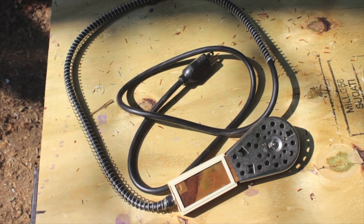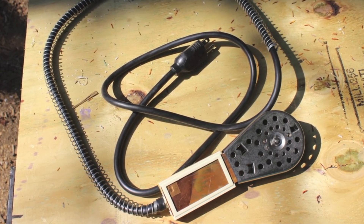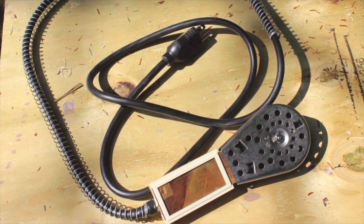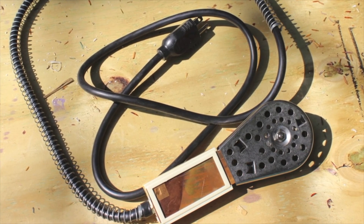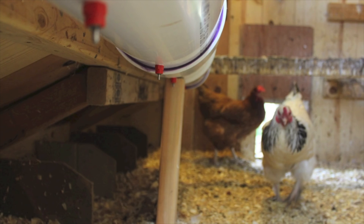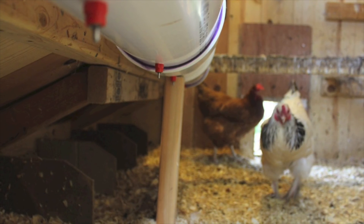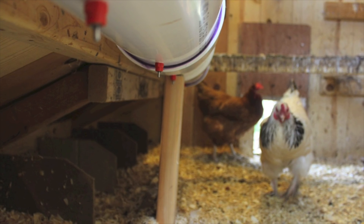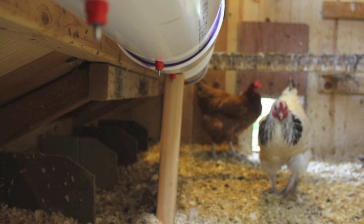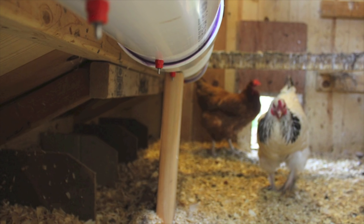Here's what I'm using to keep the water from freezing: a pail and birdbath de-icer. It's 200 watts, has a thermostat, and is submersible. I'm also plugging it into a GFI outlet so humans and the flock are all safe. Not only am I getting all the benefits of the chicken water nipples, but I'm also increasing my water storage capacity by three or four times. I used a 2x4 underneath to help support the weight, and I have plumbing straps on either side, because 20 gallons of water is pretty heavy.